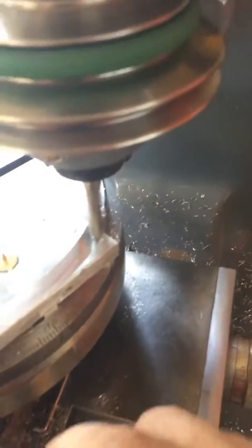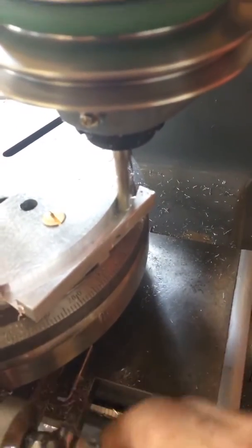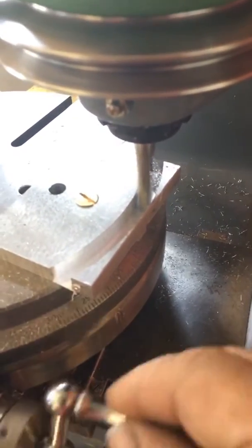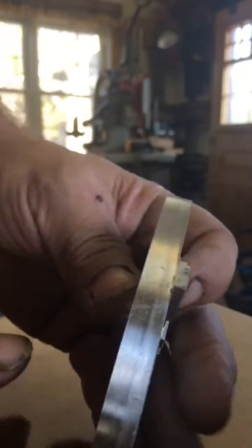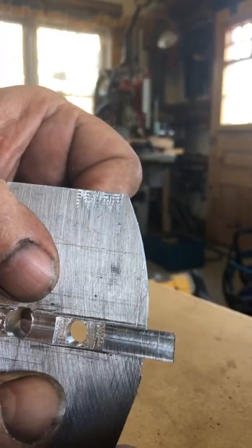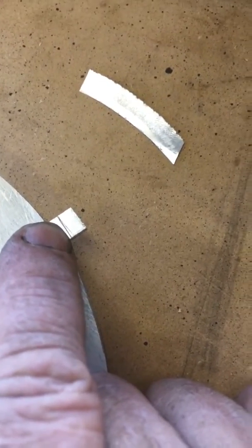This is the cleaning pass — I just left a whisker of thickness on the table and I'll cut that with a knife. So I cut that away, that is just scored, and that leaves a very crisp edge. I put a little knife mark to where it stops, so as you can see on the keyway there is a razor blade mark. I'll grind that and that tells me where it is to within a thou. I'll still dial indicate if I need closer.